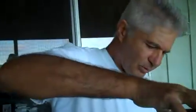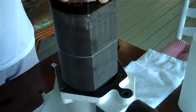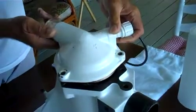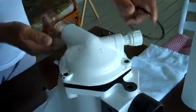The second thing I did was, of course, I completely sanded the outside and repainted it. The only difference between this and the one you may have is that this has been machined slightly here, so it's slightly smaller. And what happens is that this intercooler core, when it goes through here, is now going to be slightly taller, and so you just have to make sure that the end caps will fit properly and not allowing the end caps to go all the way down to the surface.